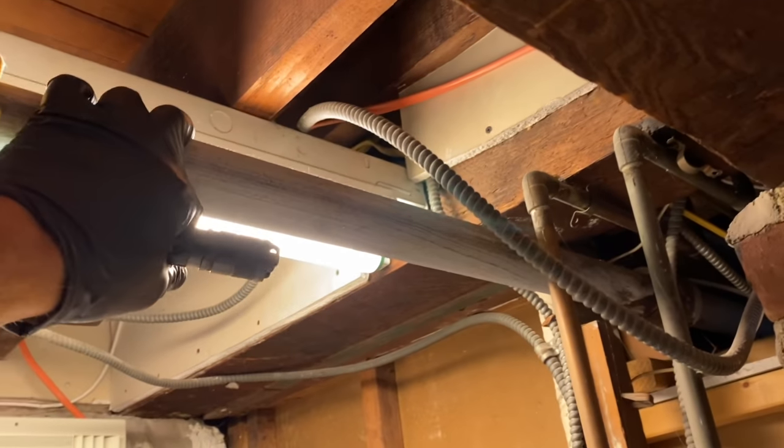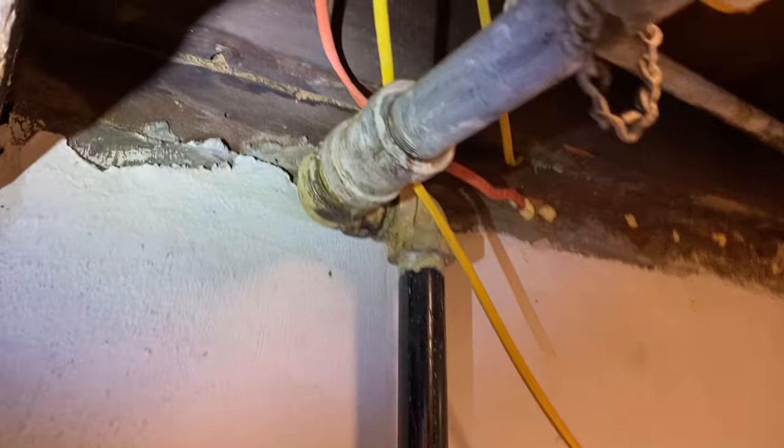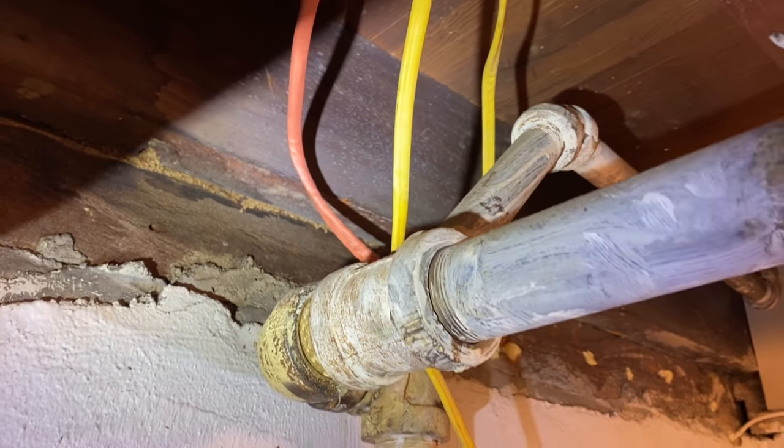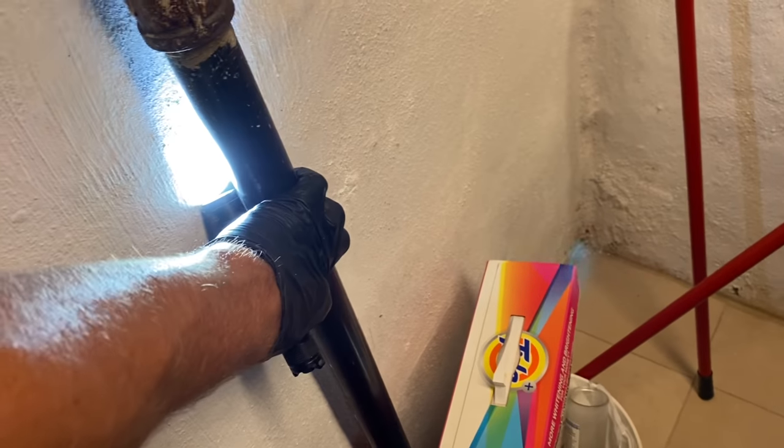All right, just another observation. There's the steam main, which then goes that away. And he told me about that one. But a good technician is observant of his surroundings. Here's another one, which is hot. And we don't have a steam main vent here. Air valve, sorry. Steam main air valve, not a vent. Air valve, that's what it is. And there's another wet return, which is hot. It is hot.